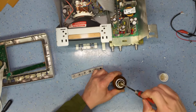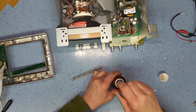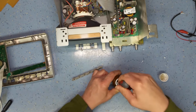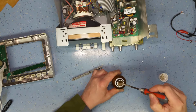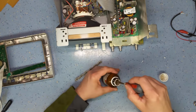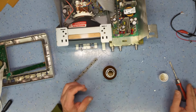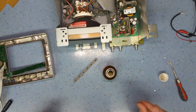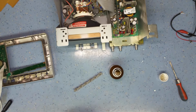And this silver paint I'm using here, we do use this at work. This is designed to protect high voltage encapsulated modules to prevent them flashing over at high altitude, and it's conductive paint, but it has a very limited shelf life. As you can see, I think the shelf life on this is November 2006, so even though we can't use it in military applications, it can still be used if you've got the time of mixing it up with a bit of thinners, and you can get it to stay liquid. That's the big problem with it. It does tend to become very solid with time.